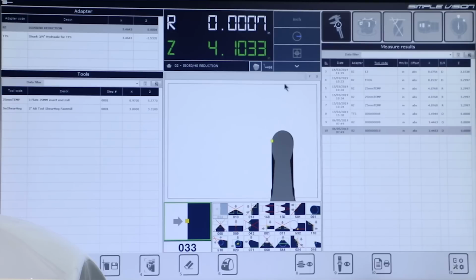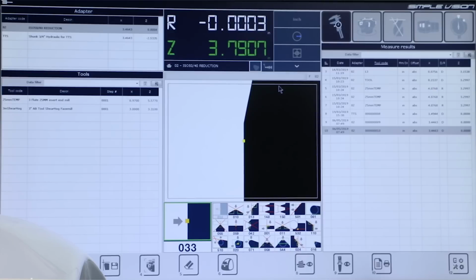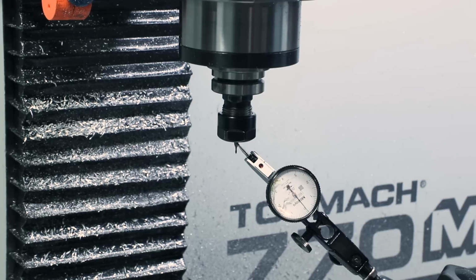And here we got 7/10,000ths of an inch, which is quite a bit of runout and more than I would like to see, especially on a tool this small, which is perfect for our first test, which is to run the quote-unquote bad side. Now let's see if we can improve the indicated reading or the runout of that tool, and we're going to do it with a way that you may not agree with, but let's test it.